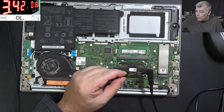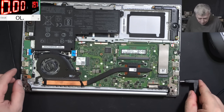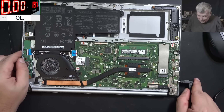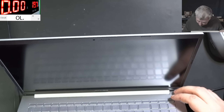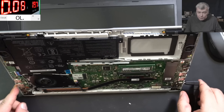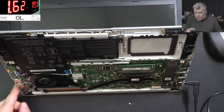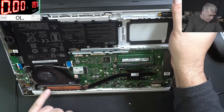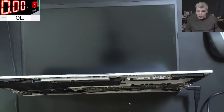Let's see the current - we have like five amps. Five amps, let's plug the battery. You know, so many laptops we just find a shorted capacitor. Okay let's wait. We reset the bus because the battery was not plugged - we have to wait a little bit. We have the charging light here. So it is charging - I can see over three amps.